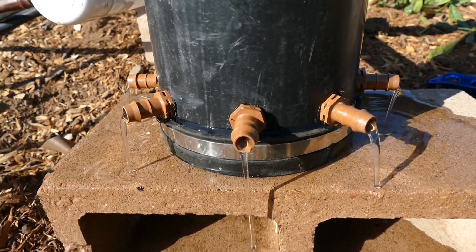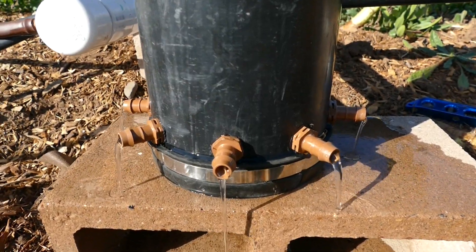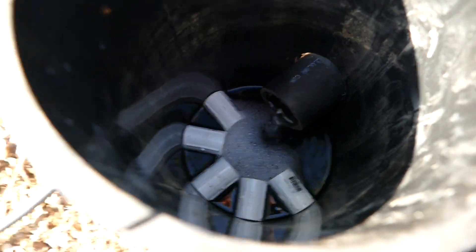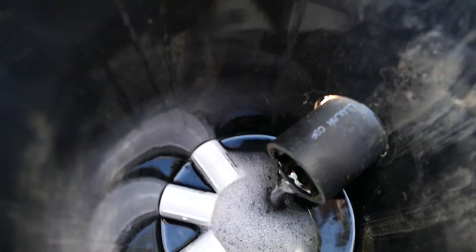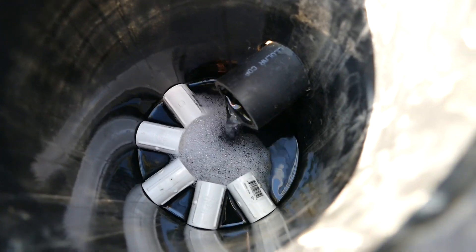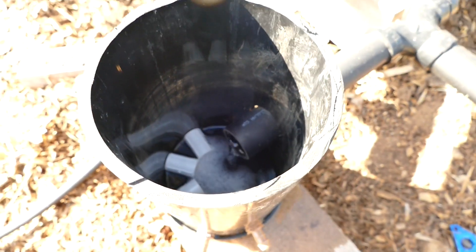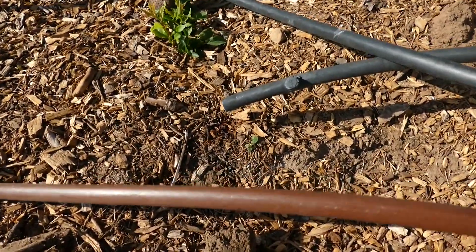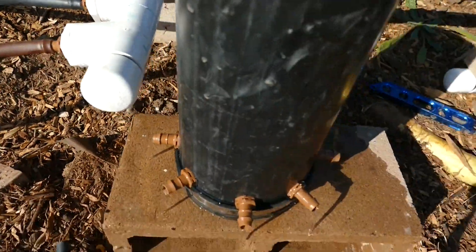So far I am liking this system a lot — this looks great. The last thing I have to do is connect up each hose out here and that's it. This is the improved gray water distribution box. It pours out of the inlet pipe and each of those lines takes the water out. Remember to check in on these every month or two and make sure scum isn't blocking the outlets — in a gray water system, scum will get in there; it's unavoidable. On the other side you can see the old-style one, and it's just not balanced — one outlet has a tiny drip and another one down the way is flooding out. This new system looks much better.